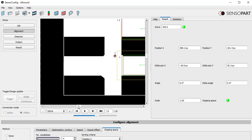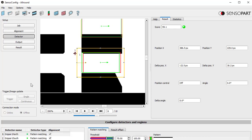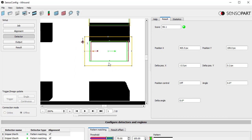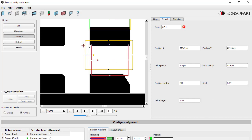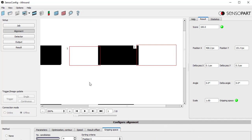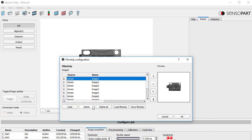This leads us to the next point. Suppose we had a gripper that had a bar on one side and a pin on the other, where the pin was much longer because it had an air cylinder you had to get into the gripping space as well. Let's go back to our first image and make the gripping space a little bit bigger and try again. Now we've infringed on the other part earlier. Similarly, we could move the gripper space detectors to the right and left if we want to check and grip the part from the short side.